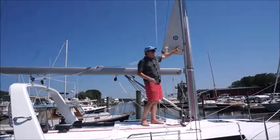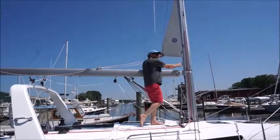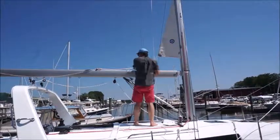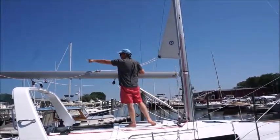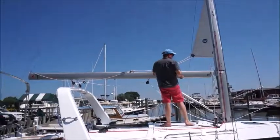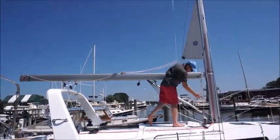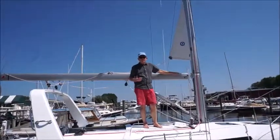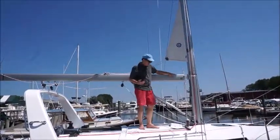Notice you have a mast that's 45 feet tall — that sail's going to come out through a very narrow slot: friction. There's a block here, a 180-degree turn, a block, a track, a block, a 160-degree turn, a 90-degree turn, a 90-degree turn. There's a lot of places you can compound the friction, and any time you get friction in this system, it's going to impede the system.